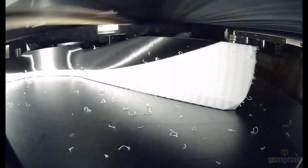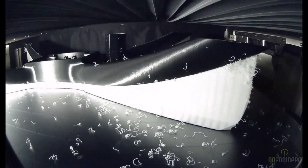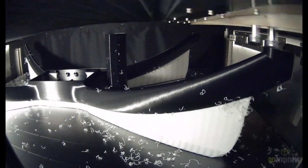There's something important I want to point out. On the right-hand side you can see that there are two pillars that fell over. The reason for this was we tried to reduce the print time as much as possible, which meant reducing the amount of support structure as well. So what happened was there was too little support material and it fell over. You can see the white strings all over the print — those strings were supposed to go on the pillars, but those pillars fell over so they had nowhere to attach to.